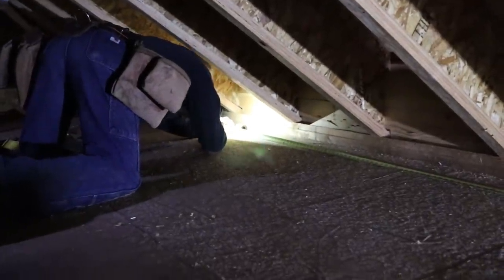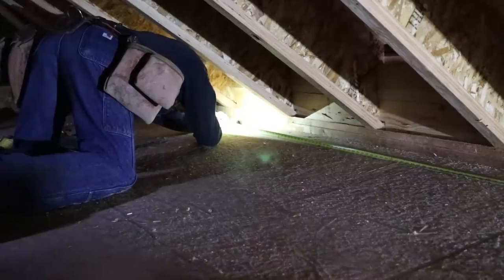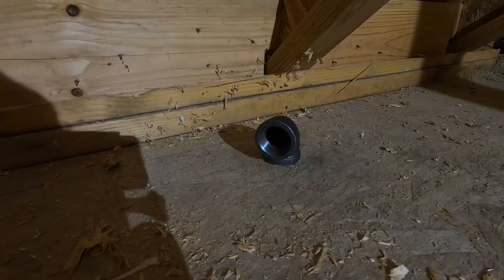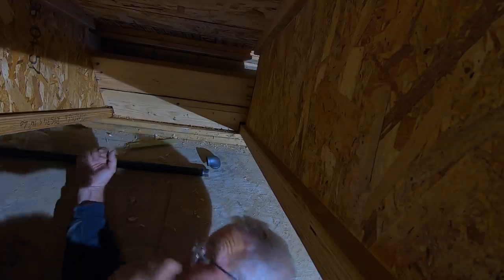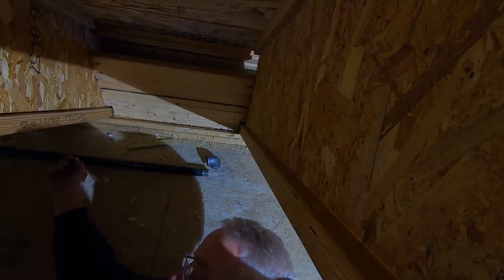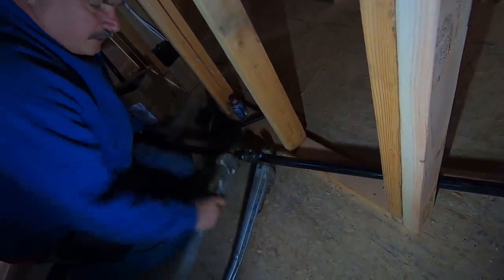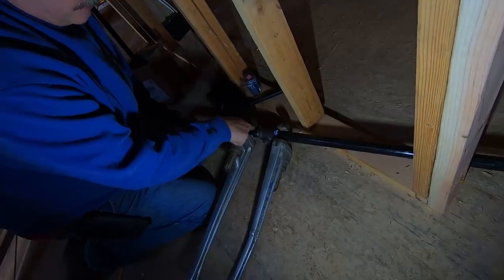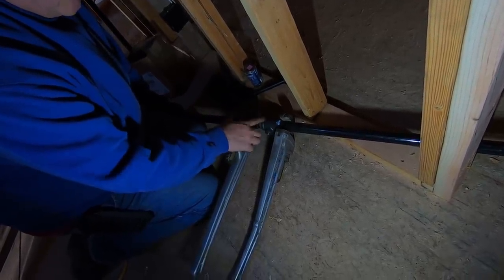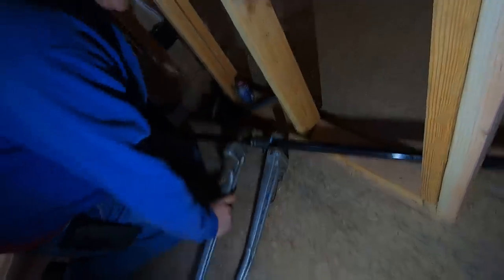We've got 172 and nine-sixteenths. Okay, remember that. Fifteen more degrees — just a little more. That's probably only about five-sixteenths of actual embed where it's sitting there now. You always have a backup wrench on the fitting and you tighten the pipe into a backup fitting. We're backing up a pipe so we're putting extra pressure on that rather than this joint. It doesn't matter a lot, but it's just something to point out.